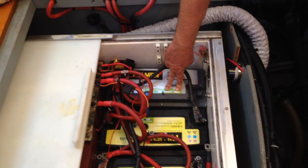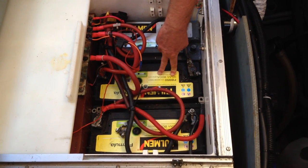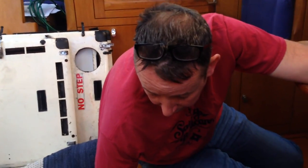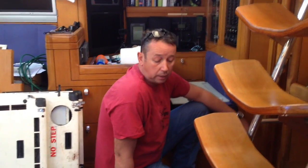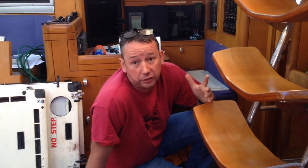So 63 out of 1000 — that needs to be replaced. These two are the engine batteries, both rated at 800 CCA, and this one with the really low reading has to be changed. What I've done is temporarily put the battery connections for the generator onto the good battery to see if that's the real problem. We should probably have tested this before ordering a new starter motor — yeah, probably — but now we've got a spare starter motor, which is good to have, and I know how to change one. I'm not a mechanic and never claimed to be, but I'm learning. Okay, fingers crossed, let's see if it starts.